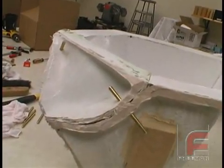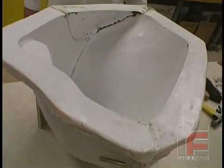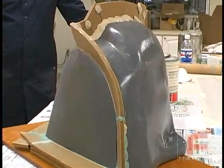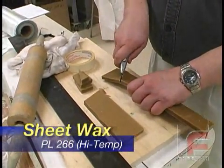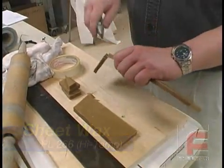This project is going to be a three-part mold with curved parting lines. To form the parting lines, we're using Freeman's 3/8-inch thick high-temperature sheet wax. We've chosen the 266 series high-temperature wax instead of our 165 series lower-temperature wax because it is much easier to bend and flex by hand.